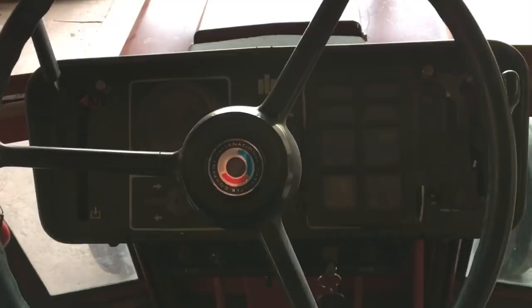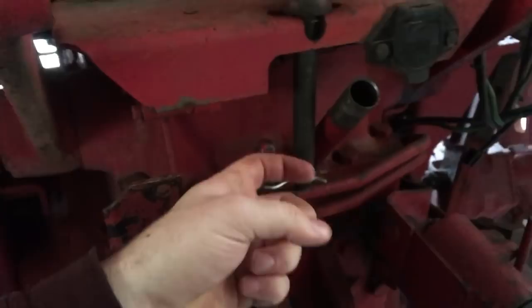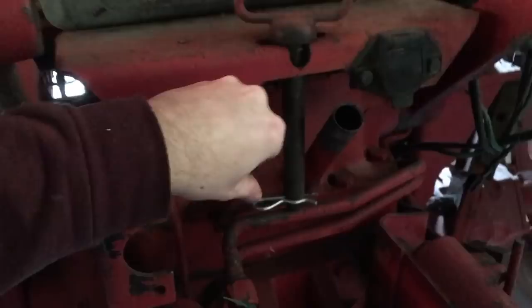I'll let it run a little bit and then recheck our hydraulic fluid level. It does take some fluid. This is where you fill it — there's a cap on the rear of the tractor in the center; pull that off, get a funnel in there, and add accordingly. Your dipstick is right here. The little ring is broken off the dipstick, but it still works and will still measure the oil level. Let me add some oil and this project should be complete.